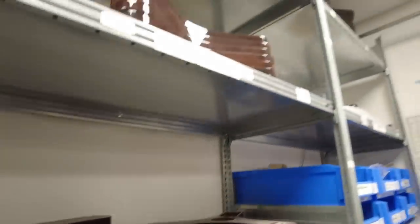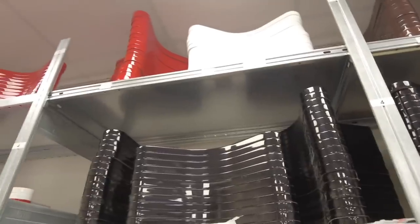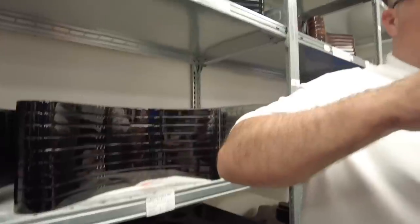So just pass this through so that you know this is heavy duty. The Panzerholz which we use, these are all the various chassis. Is that all Panzerholz? Yes. All Panzerholz. Where's that wood sourced from? This is a technical wood, which is various layers of hardwood glued together and pressed under 60 tons. 60 tons. Yes. So the big advantage of the Panzerholz is that it's not reacting to temperature or humidity. Plus, when you machine it, it's as hard as steel. And as well, it kills resonances extremely fast. That's why we're using it as a material for turntable chassis in our higher models.